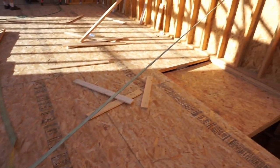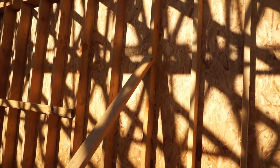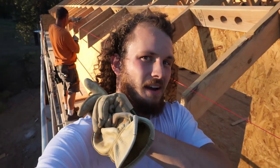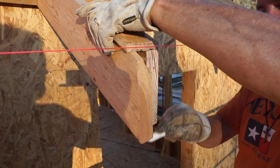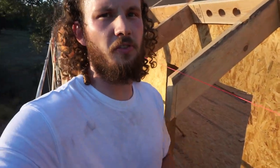And then at that point, it's all nailed down into place. So it's this east elevation here that does not have the trusses nailed to the wall. We braced and strapped to this wall to get it perfectly plumb before nailing these trusses. Now that this side is blocked and in place, we have a string line running down. My dad is marking the tails. With that mark, we're going to cut the tails off so that they're all even. And then on the outside goes a piece of fascia board.